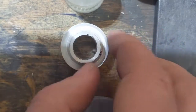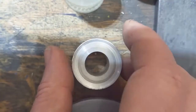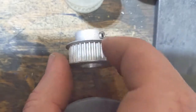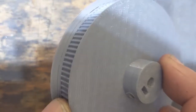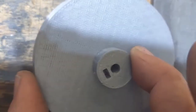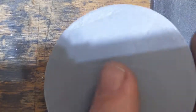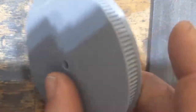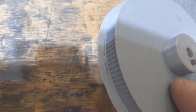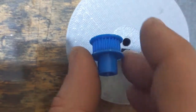The most ideal thing you can do with a pulley is just buy one. I had to bore this one out to 15 millimeters but that works fine. These are 10 to 12 bucks a piece, but when you get into large pulleys — an aluminum pulley this size could be a hundred dollars — which for a prototype is a lot of money. The great thing about technology is you can print one of these for pennies and they come out pretty good with decent grip on the belts and fairly accurate dimensions.